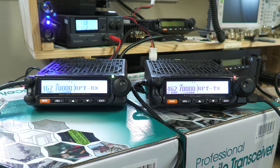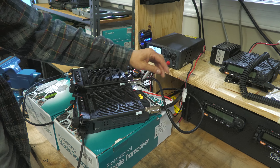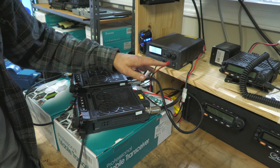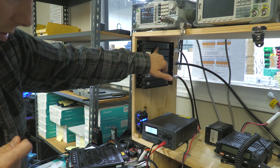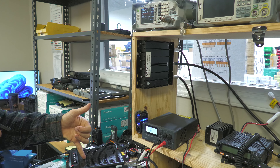After that frequency is set, I go to menu, menu option 54, repeater mode. You change the menu option with these keys right here. To get into the sub-menu, press the menu key again, go to repeater transmit, and press the menu key again — just like the other radio. So now we have it set up to receive at 467 and retransmit at 462. I have this radio on repeater 21. You can see the bars — it is receiving and then retransmitting on repeater 21.